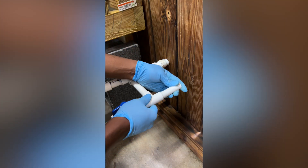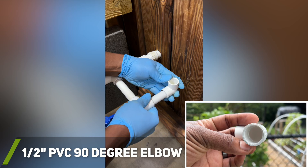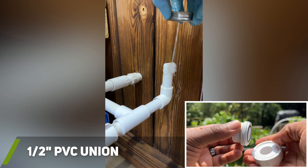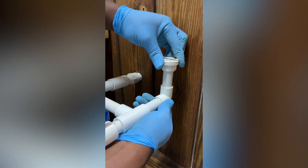I left a small gap between the wall and the one half inch pipe so that I had enough space to move the pipe insulation up and down that I will install later in the video. I decided to install a one half inch union fitting so that if I wanted to I could quickly remove the water level indicator for cleaning.